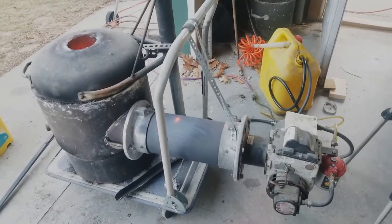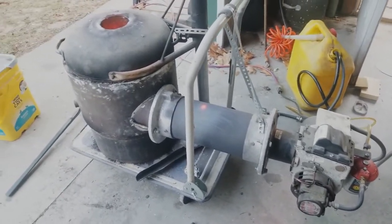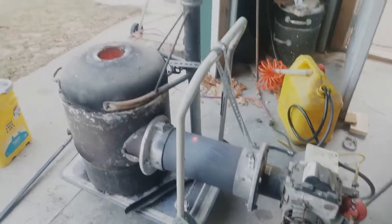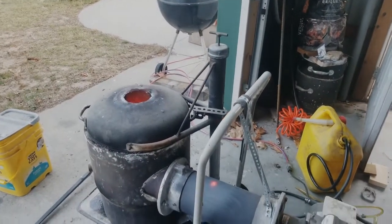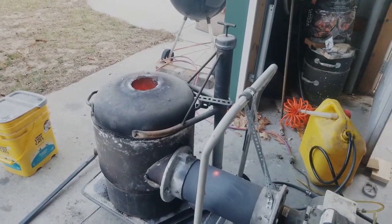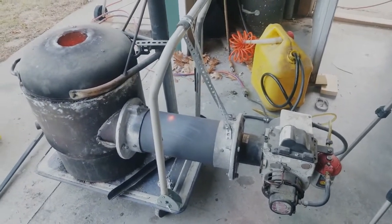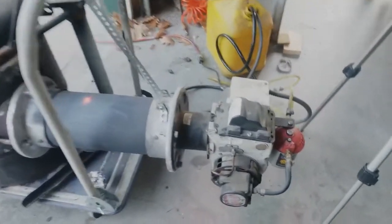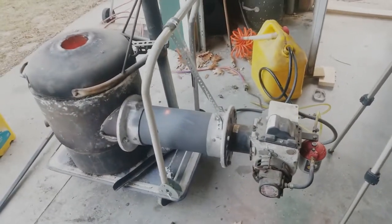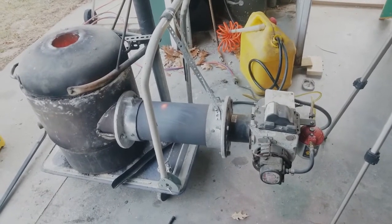So originally I had the gun right up against the furnace body, but the problem is then the flame shot out 2 feet above the hole and there wasn't as much heat inside the furnace body. So I made this extension, and yes, those are cast aluminum, so that the fire has more time to burn.